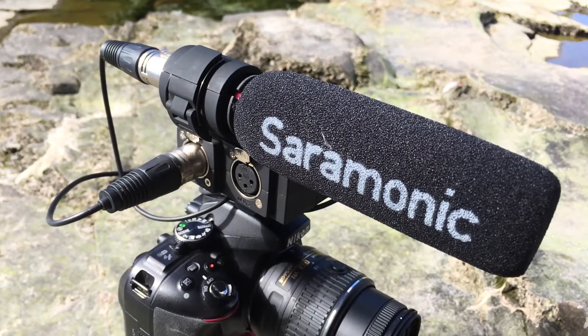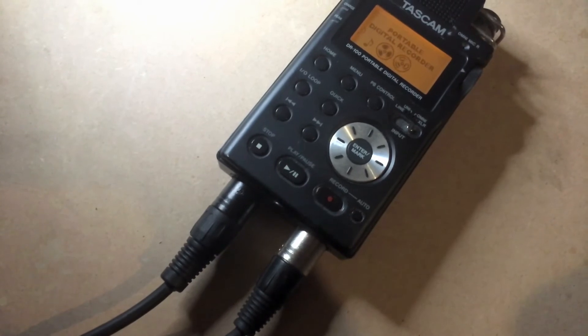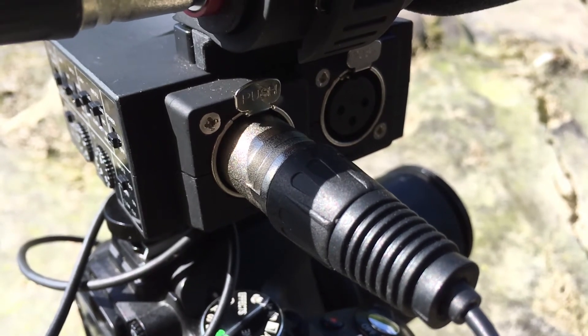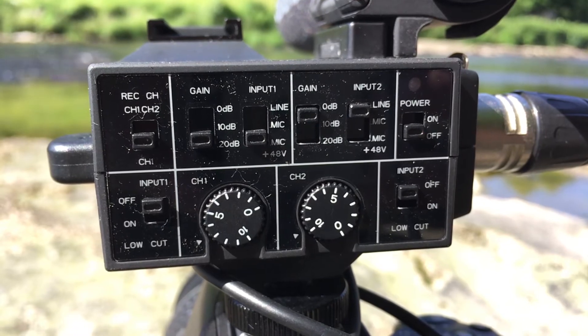The second thing is the XLR cable — it's too flimsy and it doesn't fit in the socket on the MixMic properly. It doesn't lock into place like an XLR cable should. Other than that, I really quite like the unit as a whole. The microphone is on a par with something like a Rode NTG1 or 2 — when I plugged the Saramonic mic and a Rode NTG1 into my Tascam DR100, I could barely hear the difference between the two. The MixMic unit itself is also very impressive: it's got two XLR inputs so you can record two microphones at the same time, set input levels, gain, and low-cut filter independently for each microphone.